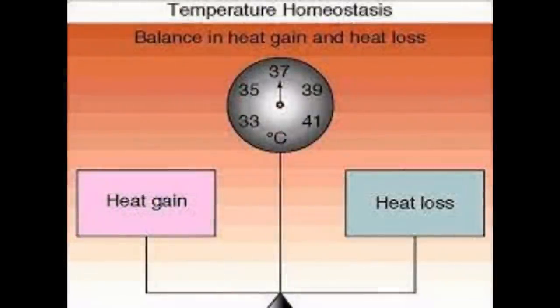And because you're banging more and more energy in, you're creating more and more heat and you're not letting it go anywhere, the temperature is going to go up. So temperature is actually more a property of what you put it in. Now, of course, there's a balance. If I were to bang a load of energy in there, high amps, that temperature is going to shoot up quickly, because we're generating a lot of heat and we're not allowing it to go anywhere quickly.